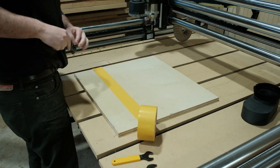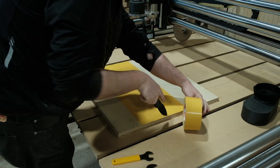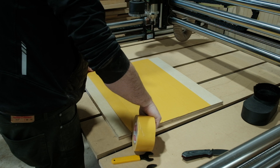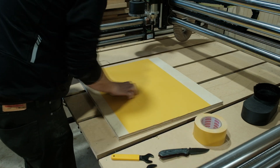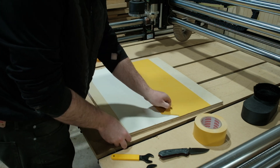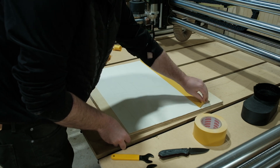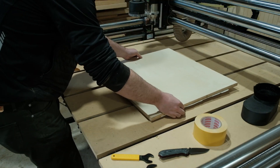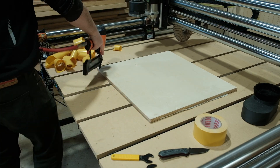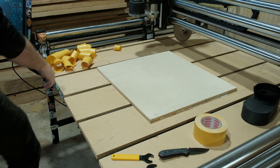If you've ever been at your miter station and you don't have a zero clearance insert, there's a bigger gap for the blade and your wood might have a little bit of tear-out on the back. A way to combat that is to have a sacrificial piece of wood underneath it. As the blade cuts through, it can't push the grain because it treats both pieces of wood as the same piece of material, and then your sacrificial one will have the tear-out on the bottom. We're going to be using the double-sided tape as that sacrificial piece of material.